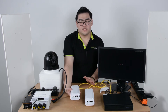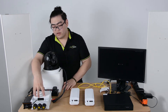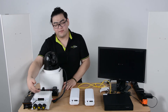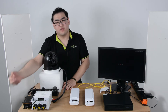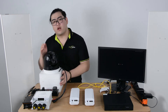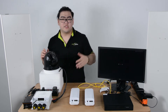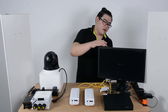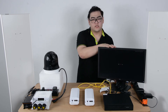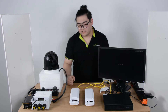Once we use an Ethernet cable to complete this connection, we have a powered switch which will receive power and data and act as a working PoE switch in the outside field. It can then provide power and data to our IP camera — our PTZ zoom camera in this case — and we can see the image far away back in our main network system on the monitor. It's really easy to understand.